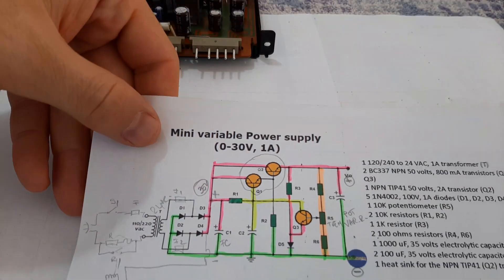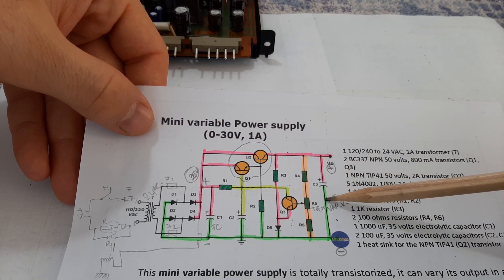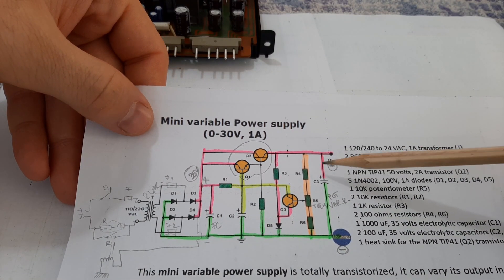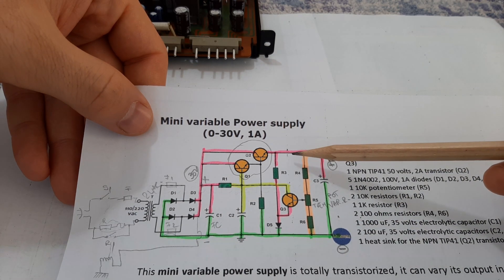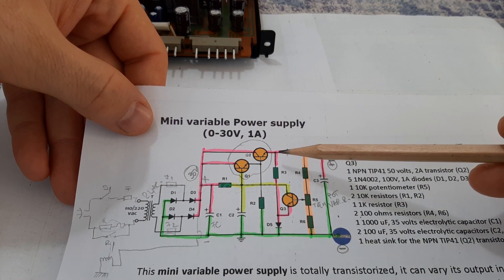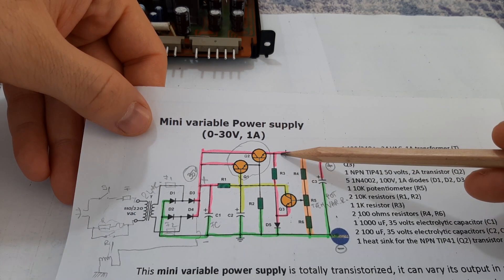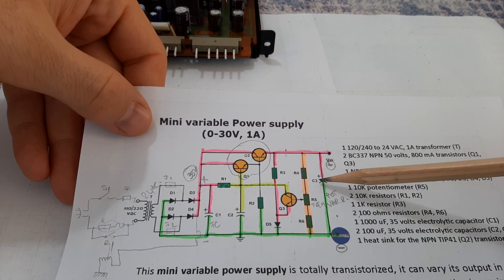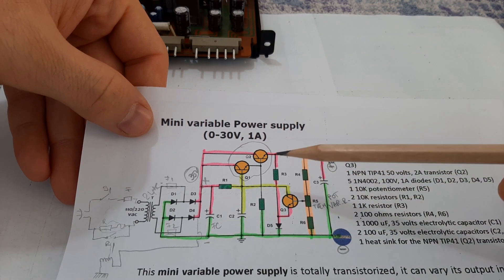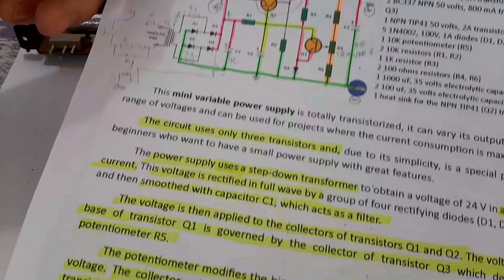This is what's going on with this capacitor. Try to imagine this capacitor is like a tank — it charges, it remains charged, and you consume the power directly from transistor Q2, which is regulating the output. This filtering capacitor helps you to reduce the ripple.